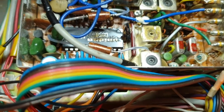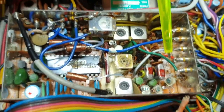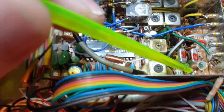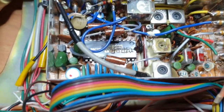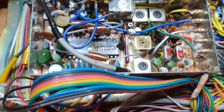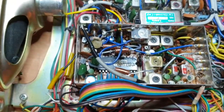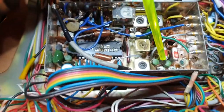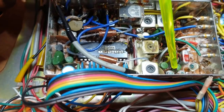I'm going to show you the lazy man's trick to sometimes fixing this problem. In this particular radio, the oscillator wasn't adjusting for the upper sideband — that's the 33.8565 MHz — and pulling the whole board out is a real pain when all you need to get to is right here.